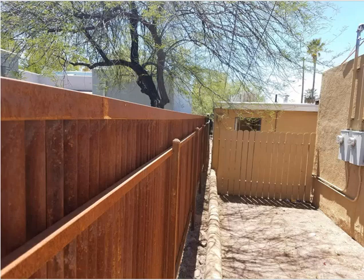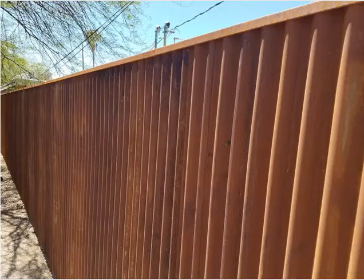If you're going to your local metal supplier, ask for a J channel. That's what that is. From the other side, it looks like this. You can see it's a little shorter on this side, and longer on the other side. It's just folded over, and it stays up nicely by itself. It stays up by friction. You can screw it or tack weld it, but then you end up having to deal with taking it off if you need to replace a panel.